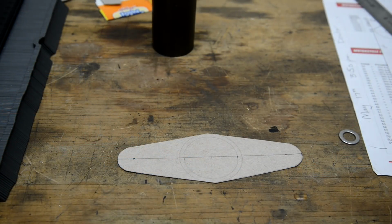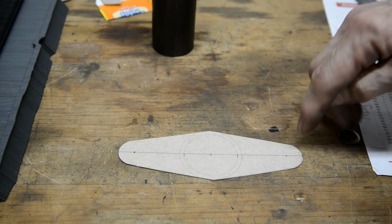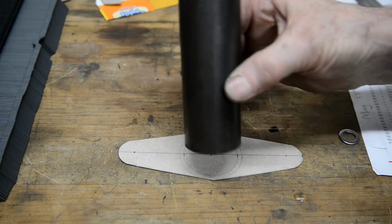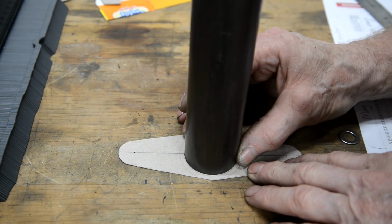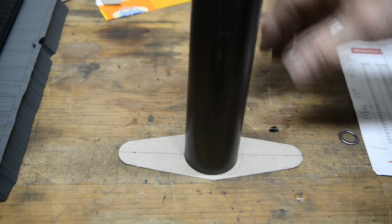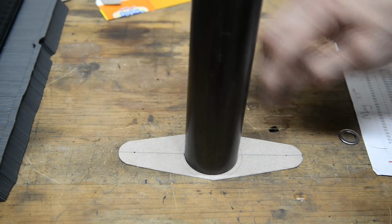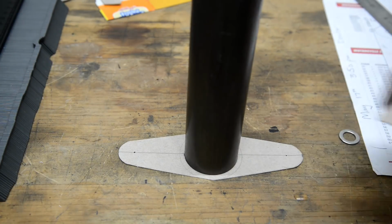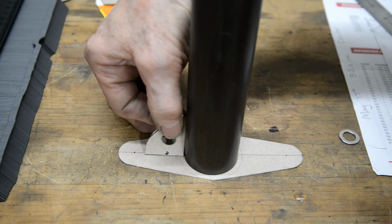Right, this is going to be the back mounting. By the way, I didn't tell you it's 80 degrees today. So this is going to be a piece of 1/8, 4130. Imagine this is the seat pillar. So that will go on there. There's just nicely enough space around to do a good bronze seam. Be drilled there and there for say 5/16. And then we'll have two of these. Like that.